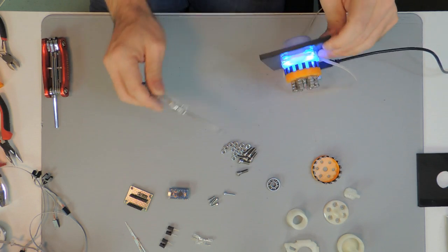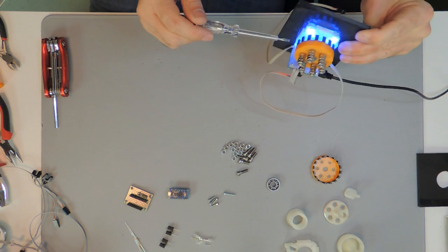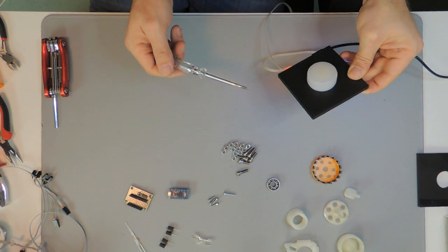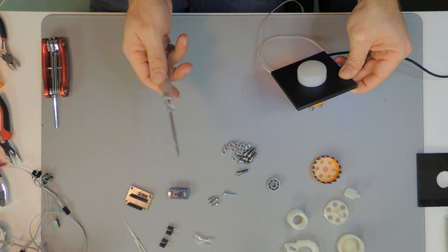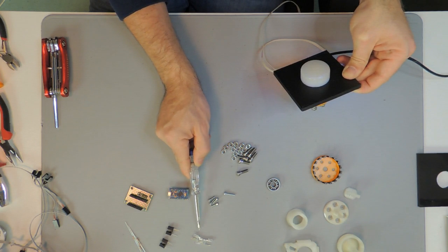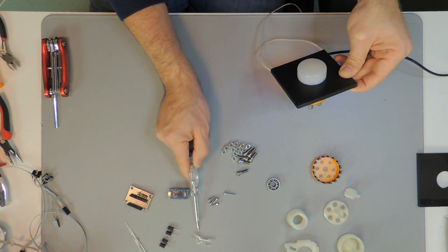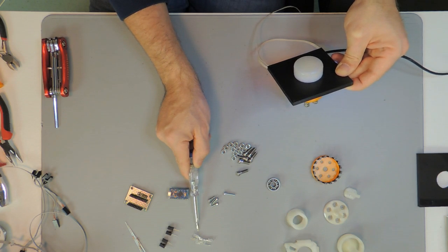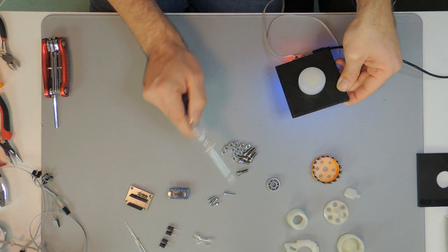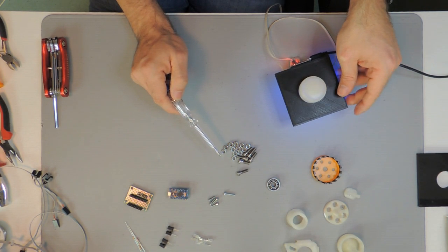If we want to go with some illumination, of course we need some LEDs. The 3D printed shapes that I'm using here allow to install up to 5 LEDs in standard 5mm housing. I decided to go with so-called NeoPixels. They have some very nice features. One of them is that you can directly address them, give them a specific color, and electronics-wise it's only necessary to have one I/O pin or one I/O port on the processor to address those. With RGB LEDs, for example, you need more than one, you need at least 3.